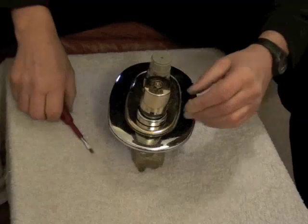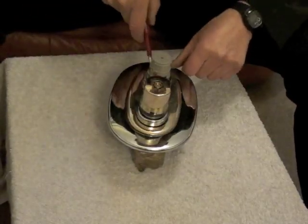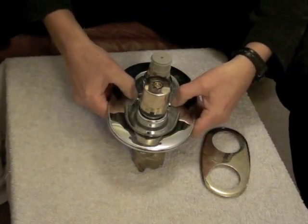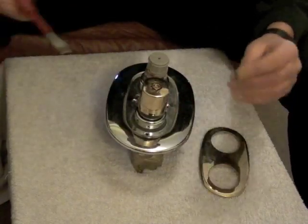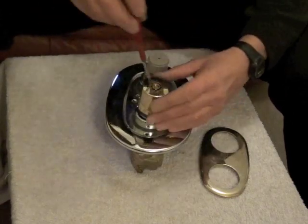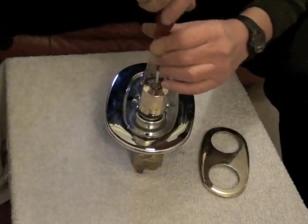Right, here's how to change this spindle. All you need to do is — I know you haven't got this piece on your particular model — but you need to take that off, undo these two screws. They're quite long and will be in the wall. Then this little cap is missing on this particular one, but it's a little cap that you just flip out.